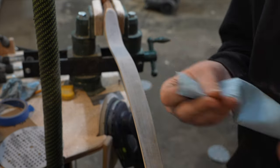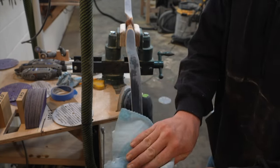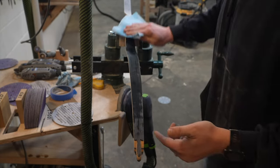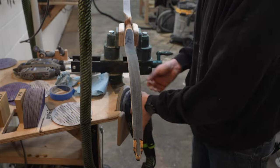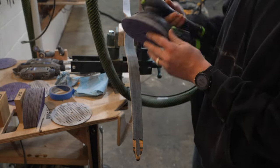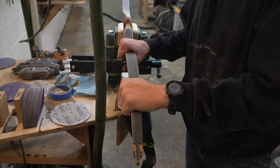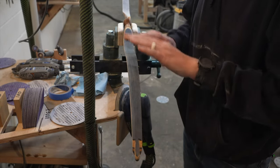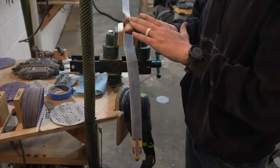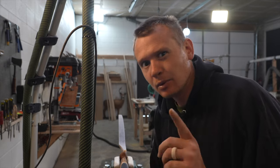No matter how good your dust collection is, it's going to leave some fiberglass behind. My favorite cleanup method is to use some acetone. I do this between the different grits of sandpaper and it helps for a better finish. You can see all that gunk coming off — what you'd end up doing otherwise is just sanding the fiberglass dust on top instead of the actual fiberglass. The other major thing is to not press hard with the sander. Let the sander do the work and that'll keep it from getting deep scratches. If you need to drop poundage and you know you have extra fiberglass, remove material evenly. In this case our final sanding will reduce it that last two pounds, so we're trying to leave as much material on it as we can. You can always take off more — it's more difficult to put it back on.